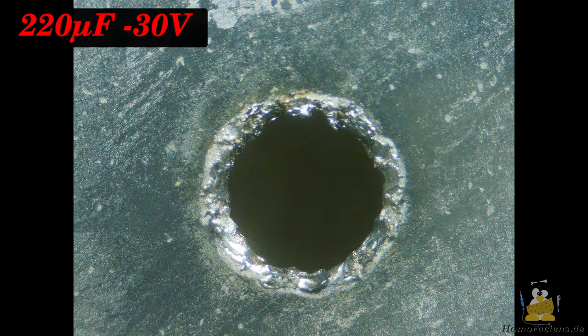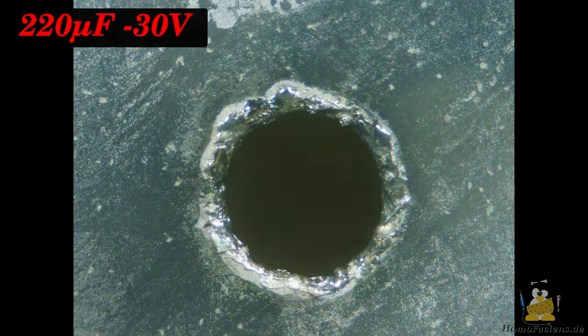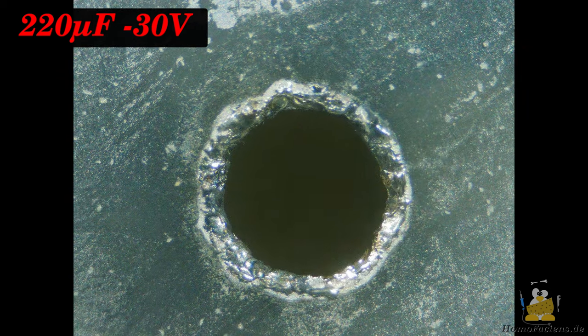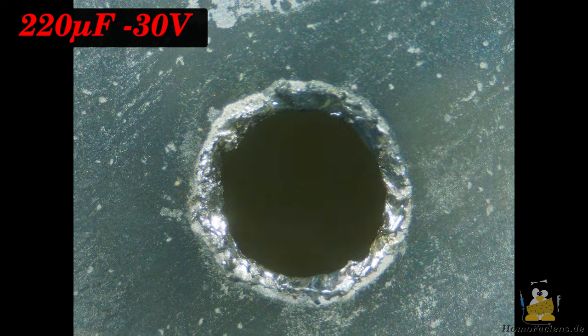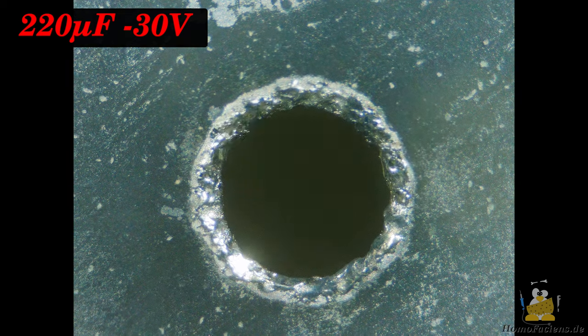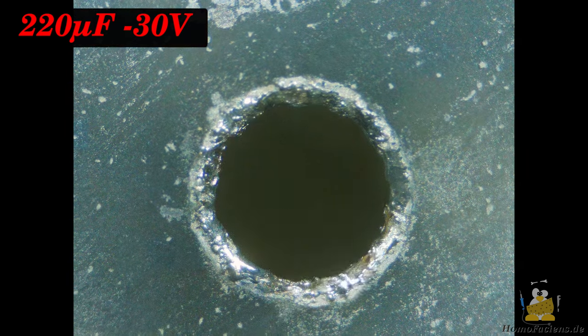In addition to the sparks, redox reactions also contribute to the changes on the metal surface. If, as here, the workpiece forms the cathode, the excess of electrons cause that metal ions in the water get reduced to elementary metal deposited on the surface.